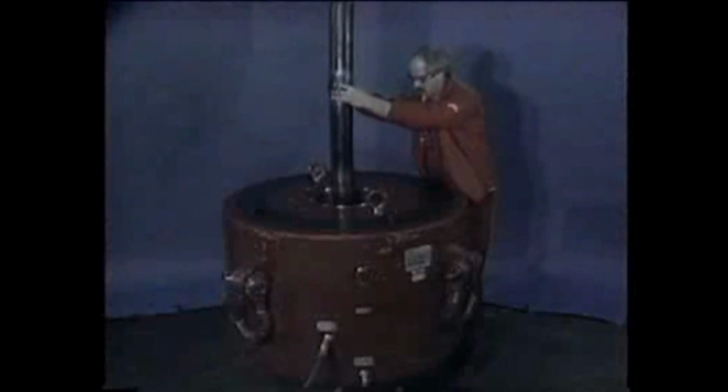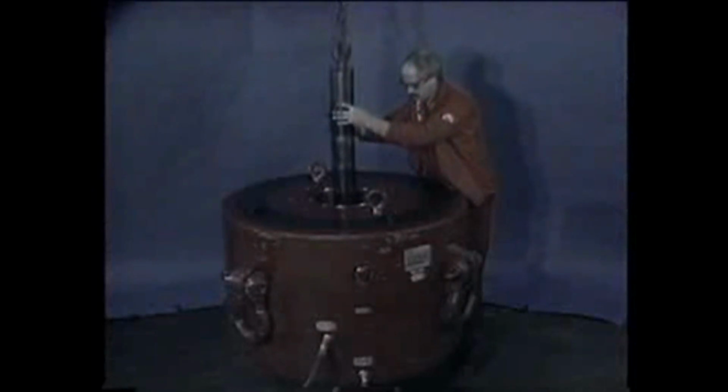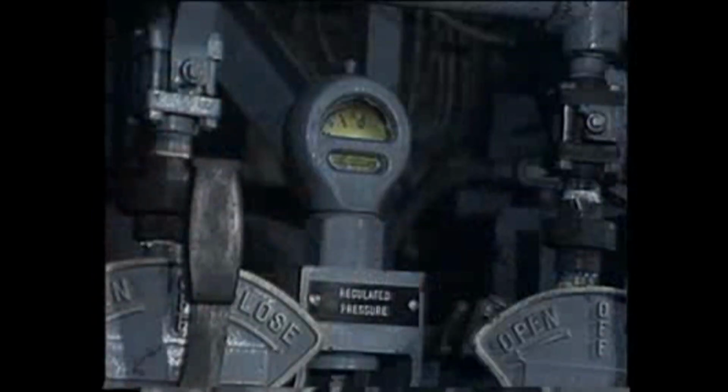Now let's check the preventer for proper operation. First, connect the hydraulic line to the close port, or reinstall the pipe plug. Stand a short joint of 3-inch to 7-inch OD pipe in the preventer bore. Apply 1,500 pounds close pressure.